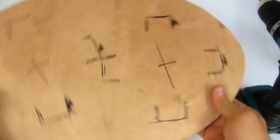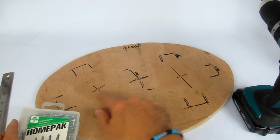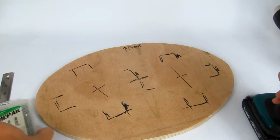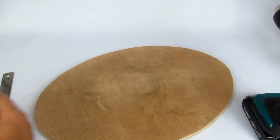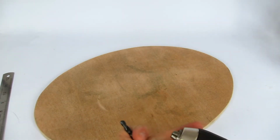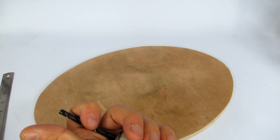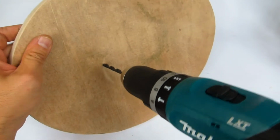Yeah, you notice it's not perfectly flat. I don't have a drill press, and this isn't really where I normally drill, so yeah. So now I'm going to swap out the drill bit so I can just enlarge the bottom here and make a bit of a countersink. So probably going to use a 6mm to do that. Just a few mils in.